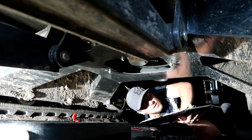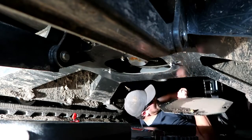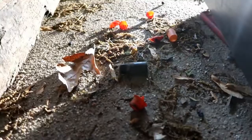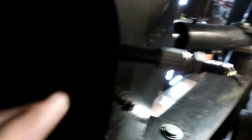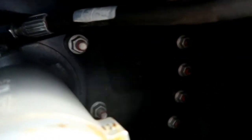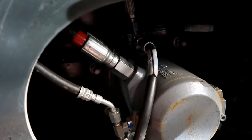Well, my goodness — look at all those caps and covers from the factory. Here's a pan that came off of here and I'm a little bit disappointed in Bobcat — they need to learn how to clean up and throw stuff in the garbage can. We got one of those caps there and a whole bunch more — a handful of miscellaneous stuff just left underneath in the pan during assembly. Anyway, back to our problem: we got this hydraulic line pulled out and that goes up into our hydraulic pump. We're just gonna unthread it from there, thread the new one up in there, and rerun this back through. These have little flanges — you loosen three bolts, take out one, the whole thing slides back a half inch and drops down, so super nice access here for maintenance.